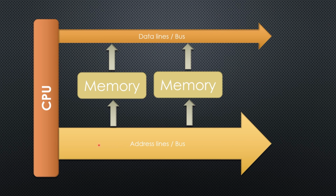What about the address bus? Do we also have to pay attention there? In typical situations, the CPU is the master and issues addresses. All others listen, so no problems here. You can connect all chips in parallel to the address bus, in theory, as we will later see.